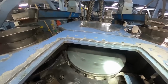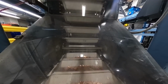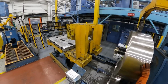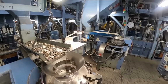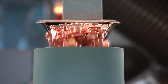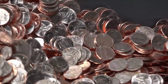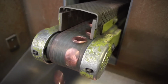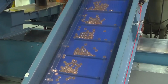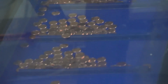At the United States Mint, coins come to life through a unique composition consisting of 75% copper and 25% nickel. The journey of these metal rolls continues as they pass through a die press, meticulously cutting nearly 300,000 coin blanks per roll. During this process, any leftover scrap is efficiently separated for recycling, ensuring its future contribution to coin production. The coin blanks emerge from the die-cutting press, resembling a symphony of metal discs cascading like a slot machine. An elevator gracefully transports them in small trays, poised for the subsequent stages of their transformation.